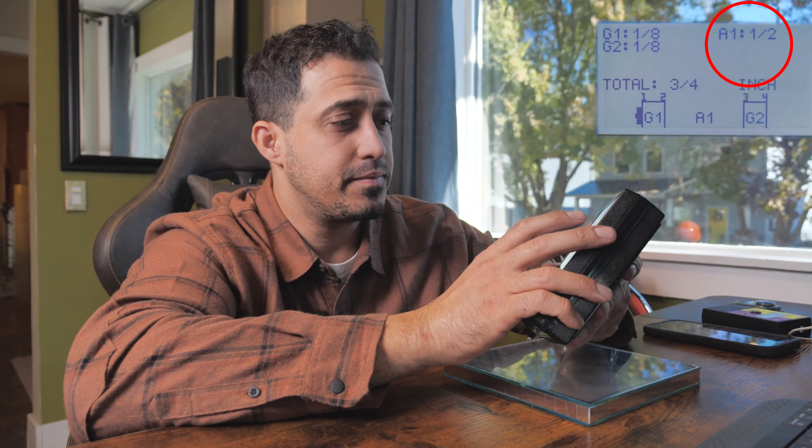So the thickness of glass and the way that it's viewed — from the outside looking in. I'm on the outside looking at this glass. This would be considered surface one. Inside of this surface, right on the interior portion where the air is, that would be considered surface two. And then on the interior portion — the inside of the house — this would be surface three. And the one facing the interior portion would be considered surface four.